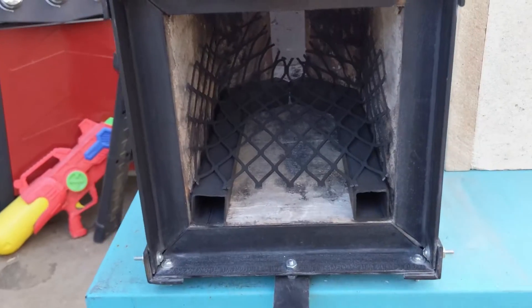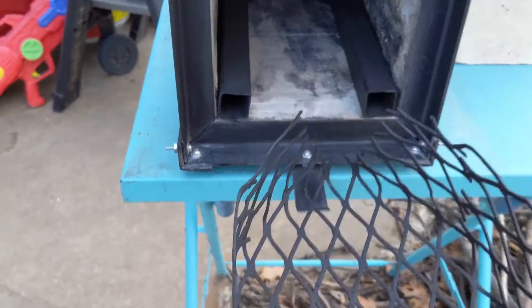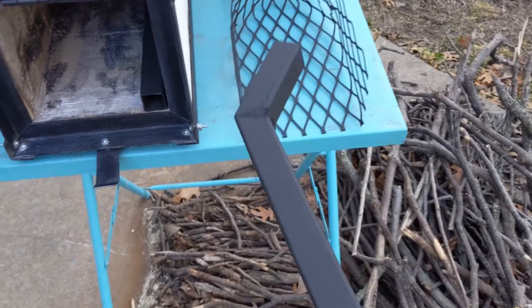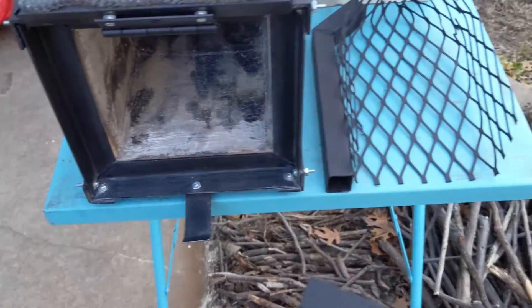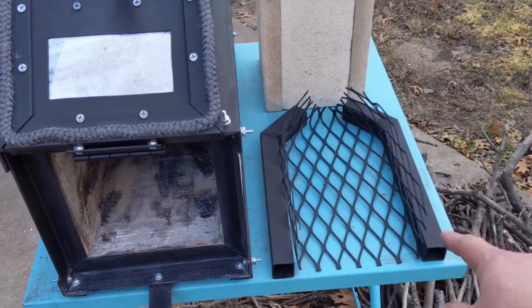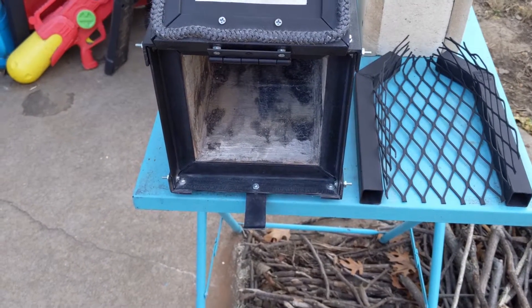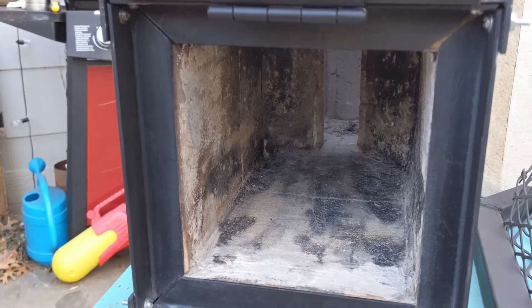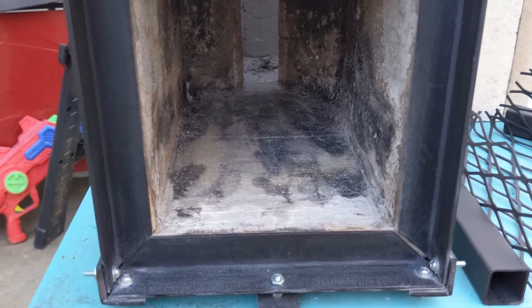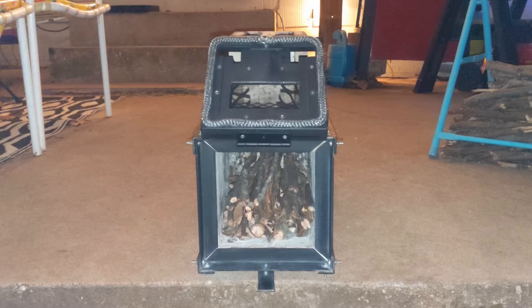On the inside I still have the metal grate. I painted it after I painted the rest of the door — put some high-heat paint on it, and also on the secondary air pipes. Since this high-heat paint is a ceramic paint I need to cure it first. I also got a tip to use water glass on the inside so it's a bit tougher and doesn't scrape the boards. What I want to see is which upgrades made the biggest difference — higher temperatures should mean it's working better. First I'm going to run it just like I built it a year and a half ago.